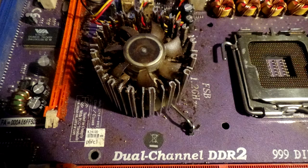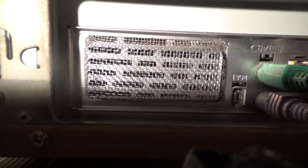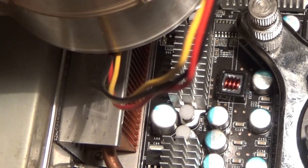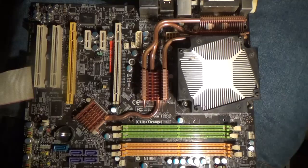This is the A-Bit AW8 Max motherboard, made after Wu left for DFI and effectively damaged both companies. The design is simply horrible. It ranks up there if only because of the suicidal cooling system: ECS placed a fan on the chipset and by the CPU voltage regulators, whereas A-Bit decided to have no fans and cool them passively — and they already get much hotter. The ECS ones barely got warm due to having more phases to spread the load over. The problem with A-Bit's heat pipe setup is that it relies on the CPU fan, and I don't have one of those in here.